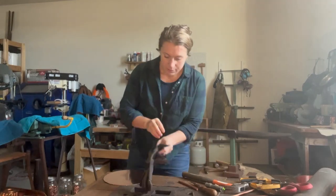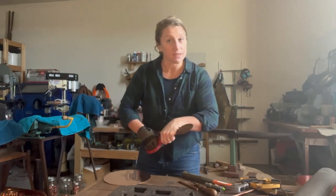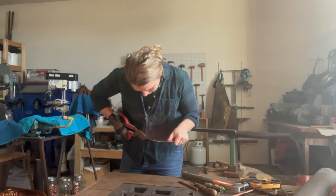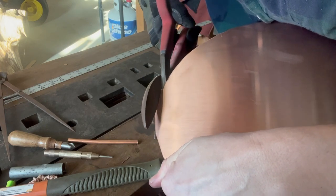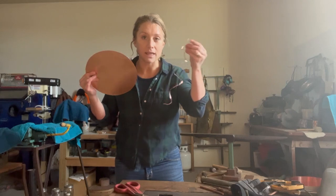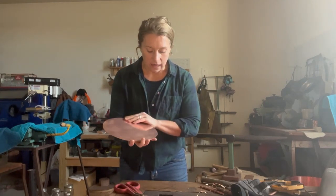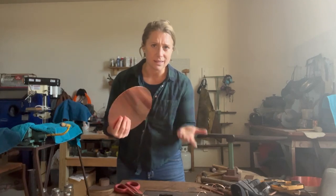Next, if you have a glove and want to use it to save yourself a couple of blisters, I try to, because blisters when you're tinning then kind of suck. But next, you're going to cut. Okay, we're done. And ideally, if you can get your whole piece in one swoop, like an apple peel, it means that you probably have an incredibly smooth circle without any major burrs that you have to take off. And that's your goal, to have very few burrs, just because sanding them's a pain. So save yourself a step, right?